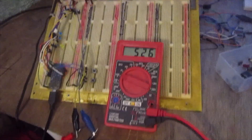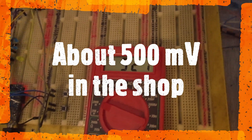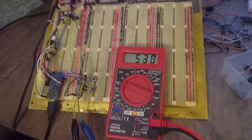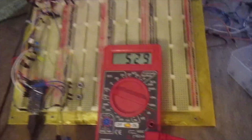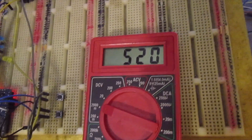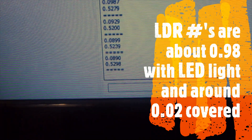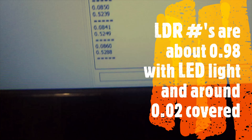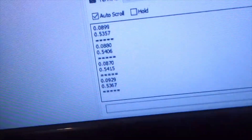Here's what my base readout looks like with just the shop light on, nothing major. Coming straight off of the solar panel it's a little over half a volt — 500 to 520 millivolts. The LDR is reading at the bottom line at 0.52 to 0.53 — that's shop light value with no flashlight. So I got that resistor balanced out to midway, as close as I could get it to 0.5.